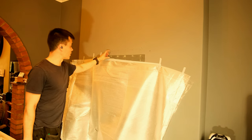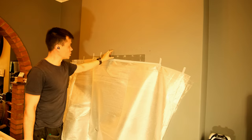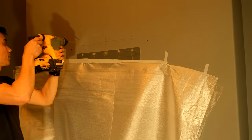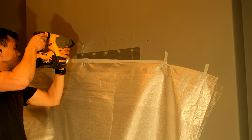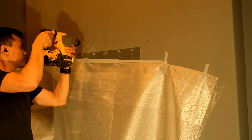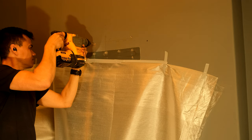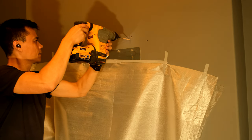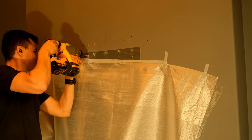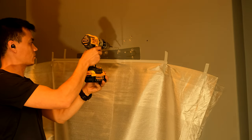The fixings are 8mm diameter, but I'm actually going to drill 6mm holes first with my SDS into my brick wall, then I'm going to use a conventional drill just to do it to 8mm. Because I find the SDS is a bit harsh and sometimes it oversizes the holes. Just going to enlarge those holes with my conventional drill.